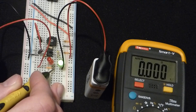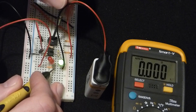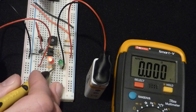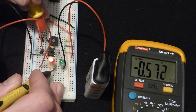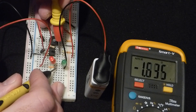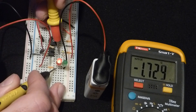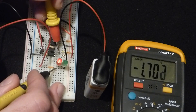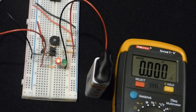At the output — connected to the resistor — the multimeter reads about 5.6 volts, so we're getting close to three times the input voltage out of the op-amp. Turning it negative to where the LED barely conducts, the input reads just over half a volt — not enough to drive an LED on its own — but at the output we're getting enough to conduct. The output reads negative, which is why the red LED conducts when the output is negative, and the green LED conducts when the output is positive.